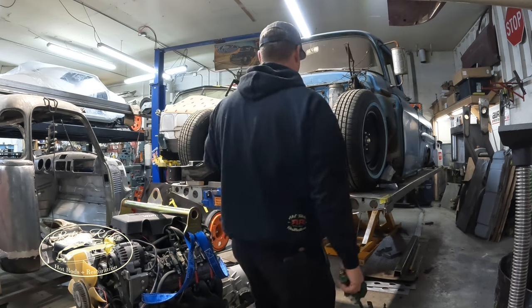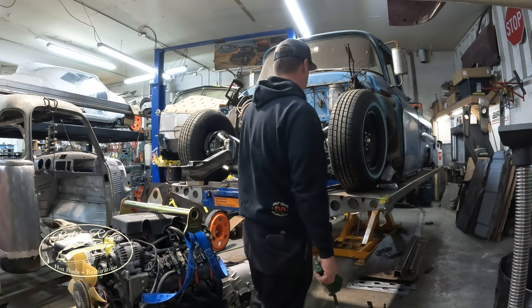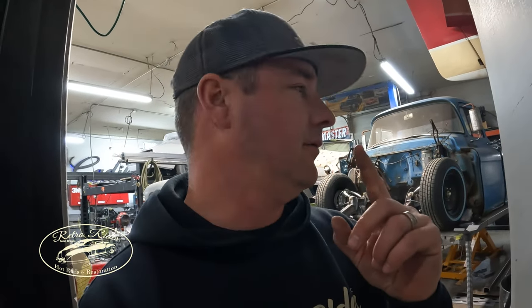I'll round up the motor mounts for this thing, see if they'll even work. So we got the Billet Rideman Ranch motor mounts, and they're kind of universal. They fit a little bracket you got to weld on. So I'll lift up this motor we have here, pull the rolly wheels off of it, and put motor plates on it.